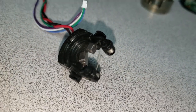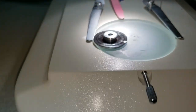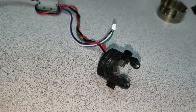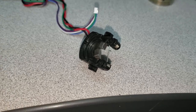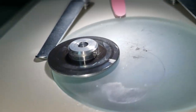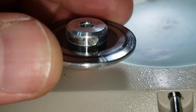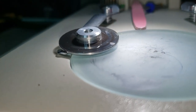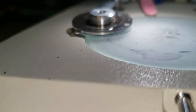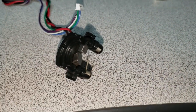This is a very frustrating minor problem to deal with. If I've ruined that now, something that is essentially a no-cost fix — or at worst the cost of this little piece of plastic and a new set of brushes — has now become a very expensive repair. This is largely because the set screw they use on this is just far too small. I'm pretty sure that by the time I finish drilling this out I have none of the original threads left, though to a point that's fine if I can thread it larger and put a larger set screw in without doing more damage.